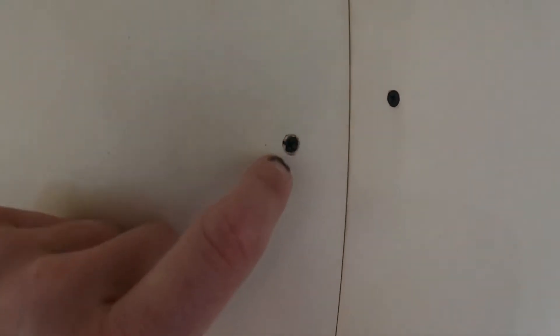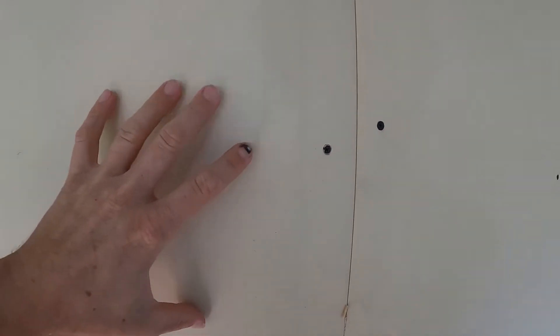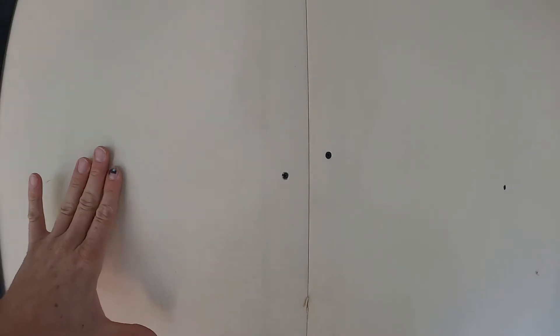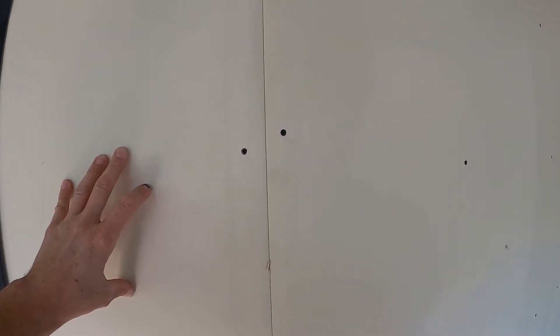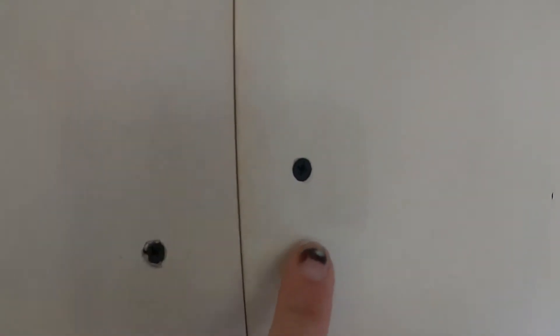We didn't do this job, so we're going to do a little bit of criticizing. That screw there is too deep. The way drywall is prepared, it has a fabric overlayment on top, gypsum on the inside, and paper on the back — all of that together makes drywall structural. It's not just a veneer; it's actually adding a structural element to the walls. So you want to maintain rigidity. When a screw goes too deep, you can see the white gypsum poking through — it crumbles in there and loses its structural integrity.